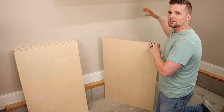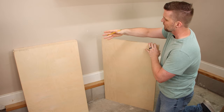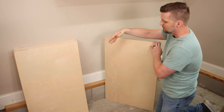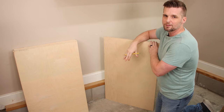I'm going to measure and mark for the location of each one of these cutouts in the location where this board is going to sit. I need one for this side and then so on down the line. I'm doing that because the garage floor may be sloped, the sill plate may be warped, it may be sitting higher in places than other places, and I want to get the right measurement for the location for each board so it'll fit right.